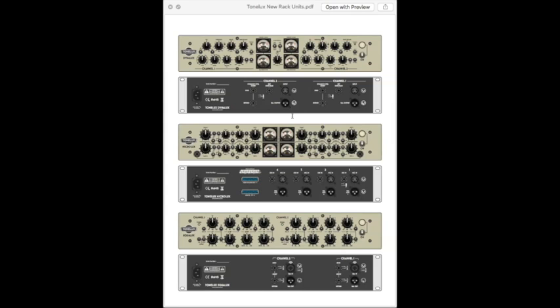But the Dynalux, if I can squeak in here. You can use it as dual mono or stereo. There's a link, so you can link the two, and you can actually control the percentage of the link from basically 10% all the way up to 100%. We included the tilt on it. You've got your threshold, attack, makeup gain, and variable attacks, your high pass filter. You've got side chain on the thing. You have insert, balance, send and return. You've got your external side chain as well. It's actually a really serious bit of kit. And we're excited to see this get out into the market. And of course, Barry, you'll get a set as soon as we do.